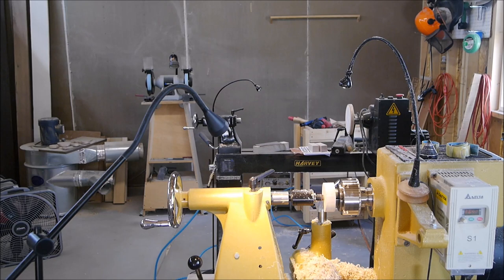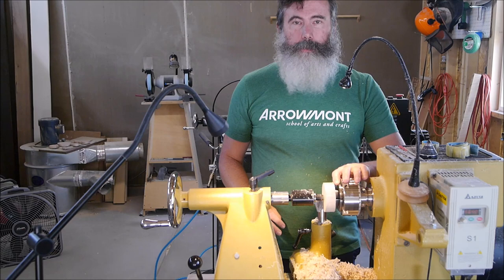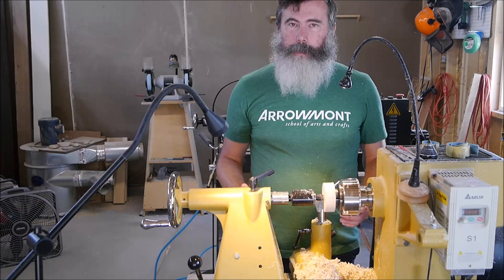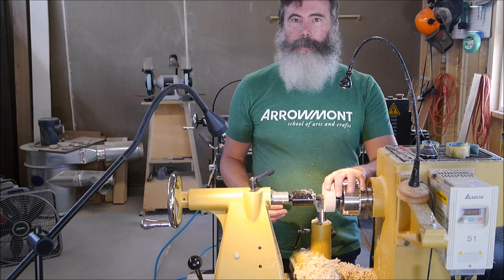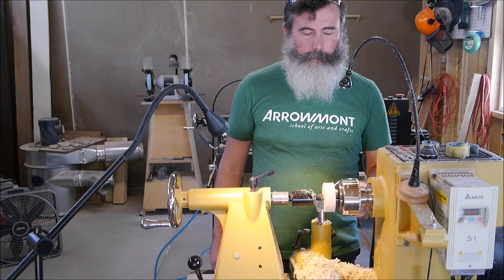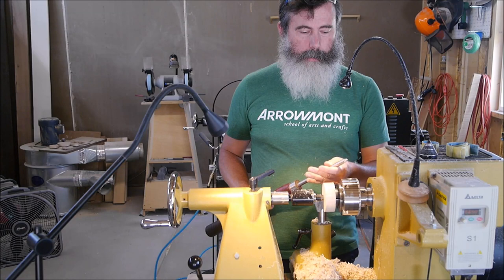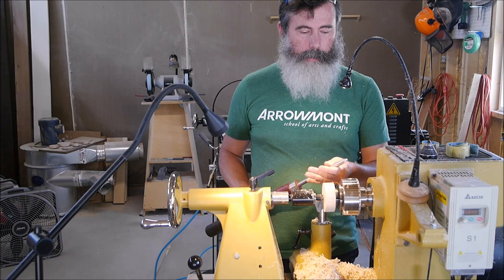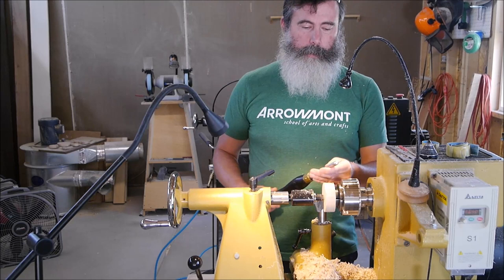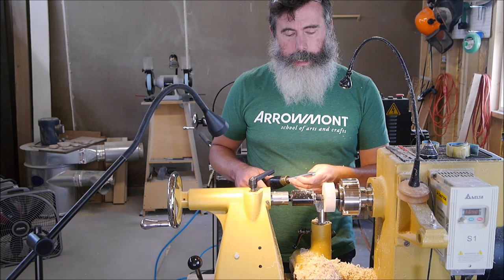Back at the lathe, I've got this next piece mounted between centers — I'm using the top of the chuck jaws themselves as a driver. This probably isn't a technique I'd recommend for an absolute beginner; a faceplate or screw chuck would be a more secure method. But for these little things, once you have some experience, it's a tip I picked up from my friend Keith Gottschall and it works great for a quick way to drive something when you're not taking aggressive cuts. The tools I use to make a tenon are just my regular bowl gouge with an Ellsworth-style grind and my spindle gouge — no specialty scrapers.